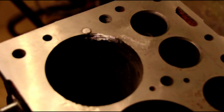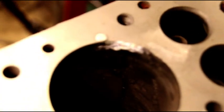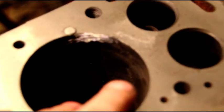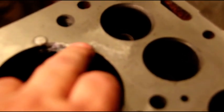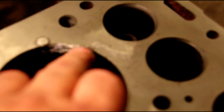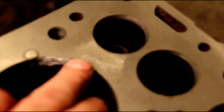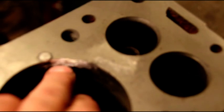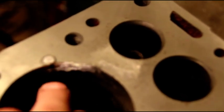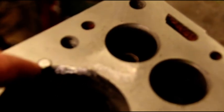Okay, I have this section right here finished. Kind of hard to see it. And then the battery on the camera died. But I did this section also. My last pin going vertically down is right there. And then halfway on that, I came in on an angle this way. So those two pins meet. And then as you remember, the crack went through here. And I put a pin at the end horizontally. And then I put another pin vertically.